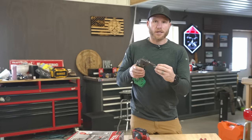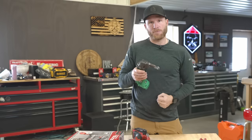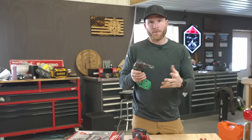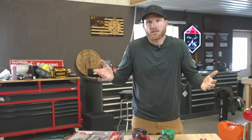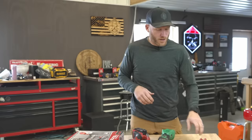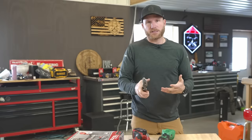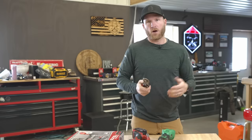Those metal moons that come out the bottom are really dangerous because they can get in your shoes and dogs' paws. Luckily we use a Milwaukee now and the Milwaukee has a little collection bag at the bottom, so we don't have to worry about that. That's why the Metabo basically sits at home. And obviously we have hand snips, which are the tried-and-true method of cutting all metal - not always the cleanest cut but you can get pretty good at it.